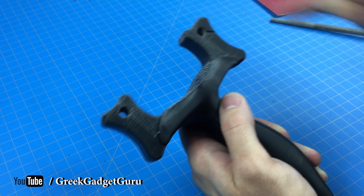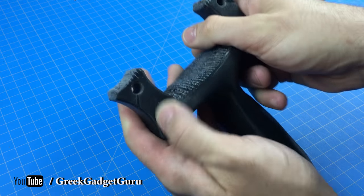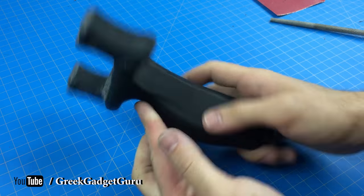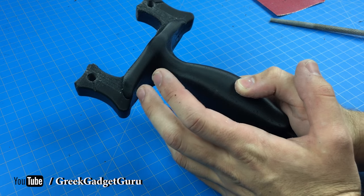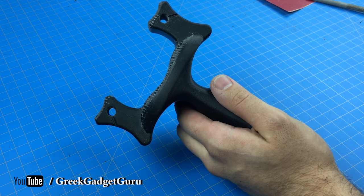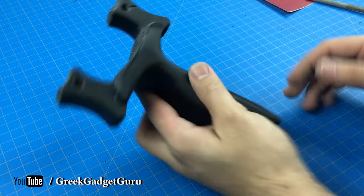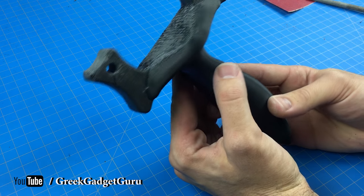That's about as far as I'm going to go because this is still just a prototype. I made this a little bit larger than the actual model size — I think this is 0.2 larger, so if it's one scale it's a 1.2 scale from the actual. The reason I did that is because I'm using a 0.5 extruder head, so everything's off by a little bit and I need to make everything a little bit larger. That's one of the cons of this type of printer.